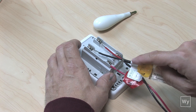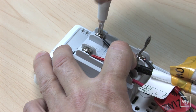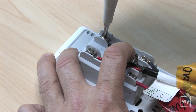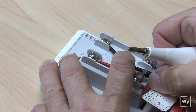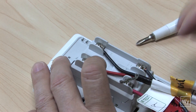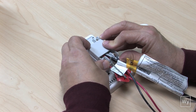The mat has no polarity — it does not matter which wire goes to which terminal. Black does not have to match anything; red does not have to match anything. Then go ahead and tighten it down, making sure that you don't put the metal bracket down on the plastic insulation. You want to see just a small hair of wire visible as you tighten this down, because if you tighten on the plastic wire insulation you may get no connection at all or an intermittent connection. The ground wire is going to go to a ground screw inside the box, which is probably already been connected once. Now, with our connections done, we're ready to put the plastic cap over the back until it snaps in.